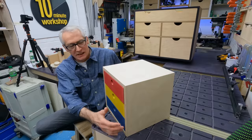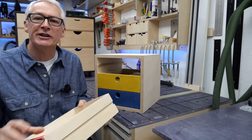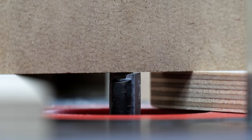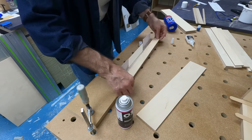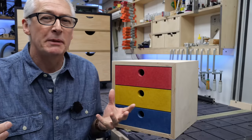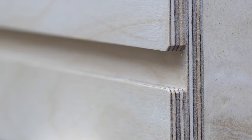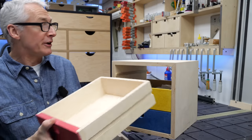Getting a little fancier next with these DIY side runners. No commercial hardware needed. These were made from 6mm or quarter-inch plywood without even using a tape measure or ruler — you just need to take a little care with the actual construction. If you're making drawer slides from solid timber, then a router in a table is the best way to cut the housing from the runner. But if you're happy with sheet materials, then strips of 6mm birch plywood to create the housing, like I used here, works very well and can simply be glued on. The big benefit is that they're easy to remove and refit. Unlike the simple boxes, the weight of the drawer and contents is concentrated on the much thinner side runners, which means far less friction. Especially with a well-waxed runner and drawer, it will run very smoothly indeed.